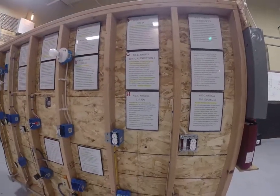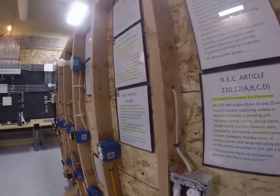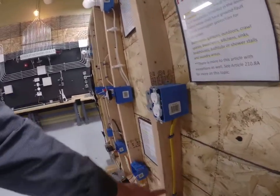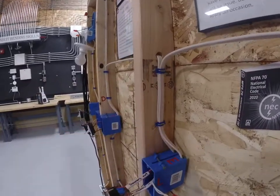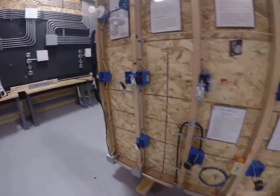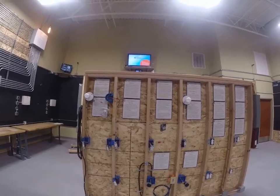I want to give brand new guys an idea of what wires should look like when they're in the walls and how neatly they're arranged. Notice the cable is exactly in the middle of the stud. Notice the placement of the staples. Everything is neat and orderly. Notice the different application of what's called a cable stacker, so we can run these wires nice. And then there's another application where some people choose to put two wires under a staple — if it's listed to do that, you can. Everything in those frames represents a code-applied situation.